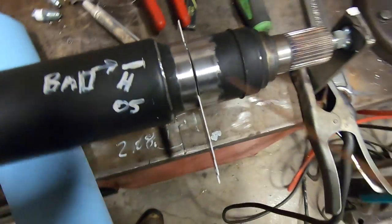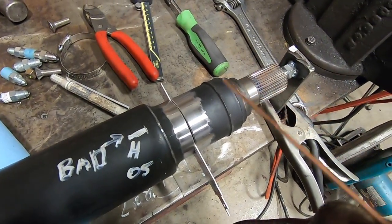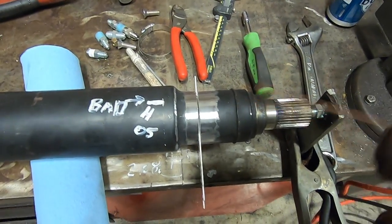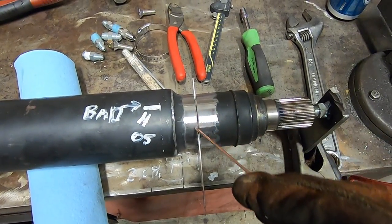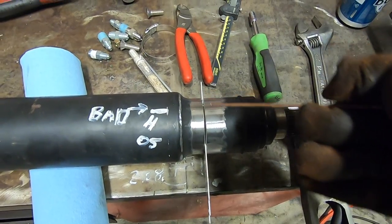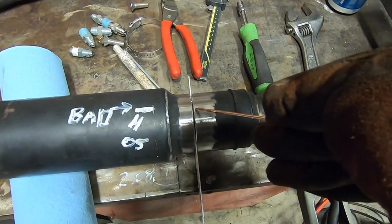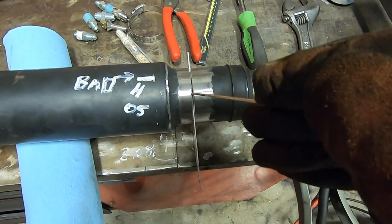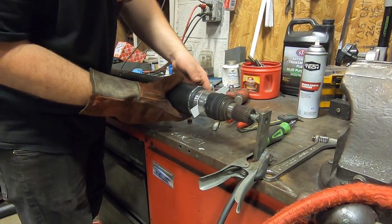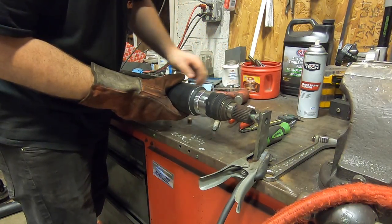I've got this fixtured up to weld. You might wonder why there's a saw blade in there — I need a gap. I wouldn't butt these up and weld them for two reasons: one, I need to be able to tack in three places and bump it around to make sure the shaft is straight; two, for penetration purposes — when you're welding pipe you need a small gap. As I'm welding I'm going to be chasing a teardrop shape opening slightly as I add filler, so I know I have 100% penetration all the way around. Once I've got one tack on, I'll gently spread it and wiggle the saw out — it just gives me space for my initial tack weld.